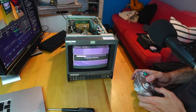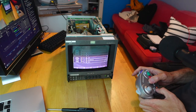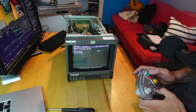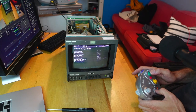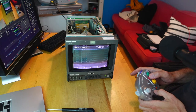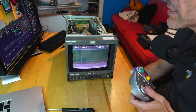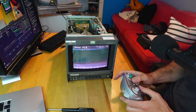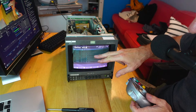Yeah, that's super flickery. I don't know what to do about that. Oh, wait, maybe. Hold on, maybe I can help with that flickering. First of all, I think this is in PAL, 480i. Alright, there we go. My camera is coming in at 60 hertz, so I set the screen to 60 hertz. You've got this big black bar here, but at least you don't have that flickering. So what am I seeing? I'm seeing a lot of color bleed here.